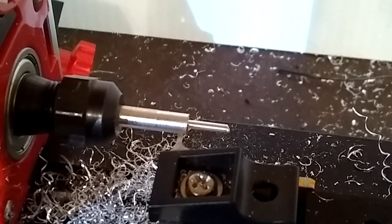So we're going to make this for, I think the O-ring is a 003, so 003 is the O-ring number, and I think it's 60 thousandths cross-sectional, which is 60 thousandths thickness, and then its ID is 56 thousandths, and its OD is 176, I believe, or 178, something like that. Anyway, that's what we're making it for: the 003 O-ring.